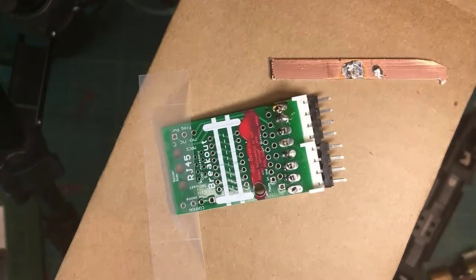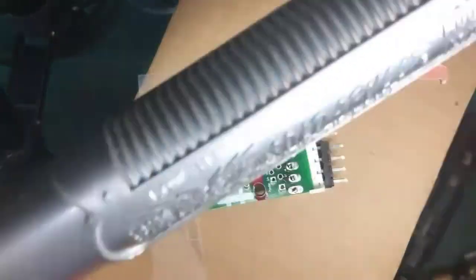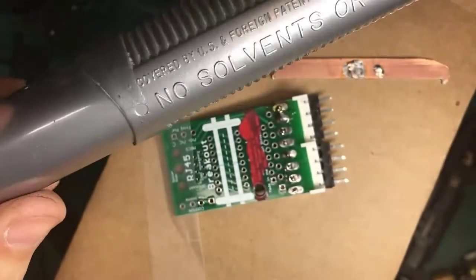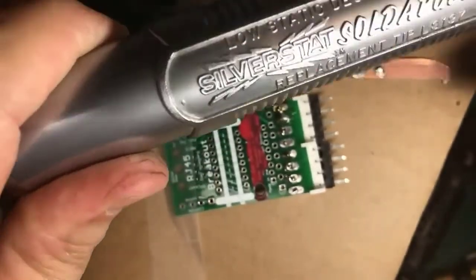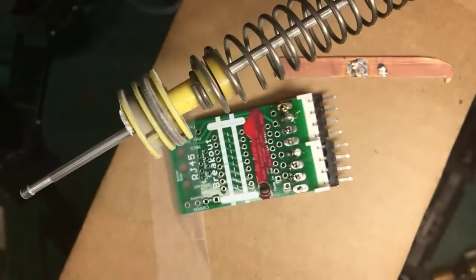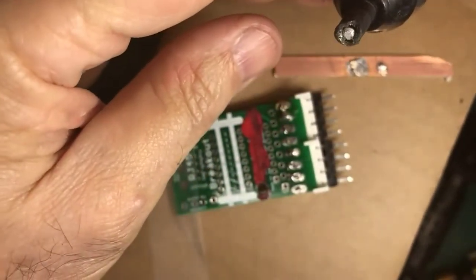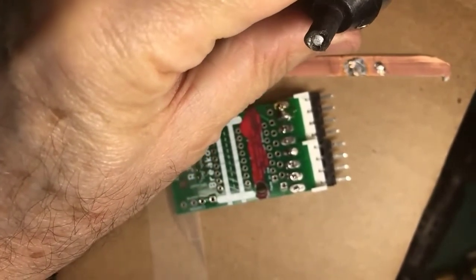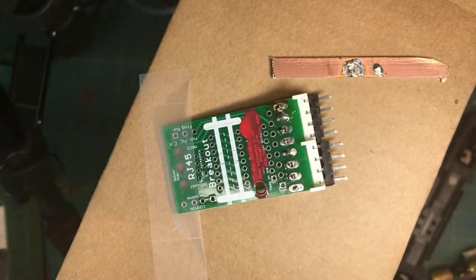Another tool that we electronics types use is a solder sucker. This one is a standard one, the Solder-Pult, and it is basically a miniature hand-operated vacuum where there is a plunger down inside the tube. There's the plunger with a seal. And this guy has a tip, you can just see the tip there. When I press the button, it draws back quickly, producing a local vacuum right at the tip.